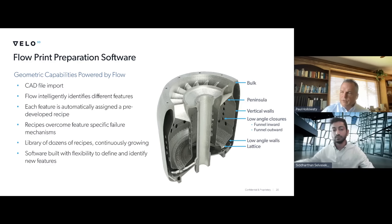This really gives us the ability — especially when we're talking about high-pressure die cast tooling — to do large cooling channels. With the growing EV market, the need for larger die cast tooling is important. As the tools get larger, the inserts get larger and the cooling channels have to be larger. So we're looking for very circular cooling channels with very smooth up skin and down skin surfaces to provide a long tool life and properly cool the part. High-pressure die cast tooling is a very rough environment. As one of my customers put it: it's easier to put a part in space and bring it back down than to create a high-pressure die cast tooling insert — you're going from 600 degrees C down to 60 degrees C in about a minute. It's very rough on the tooling.